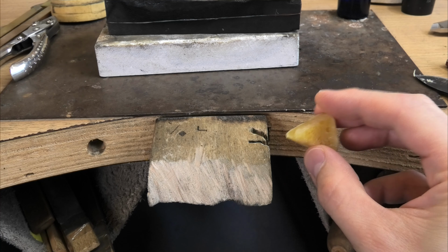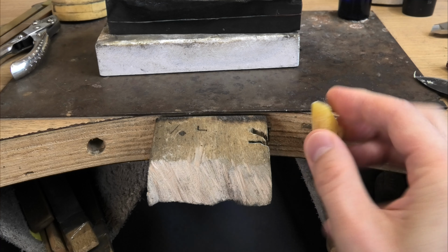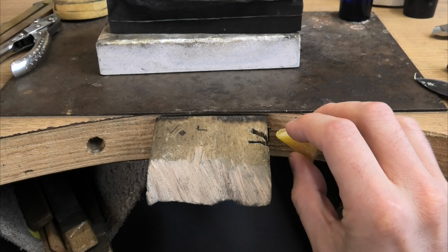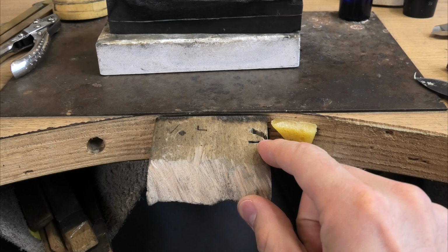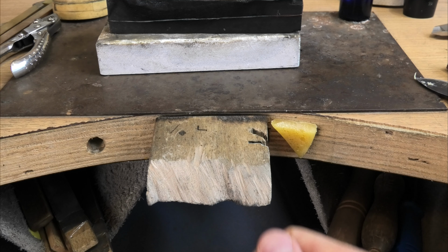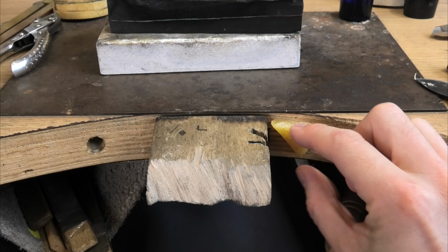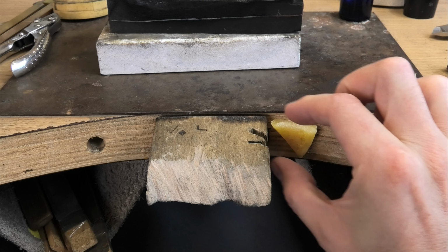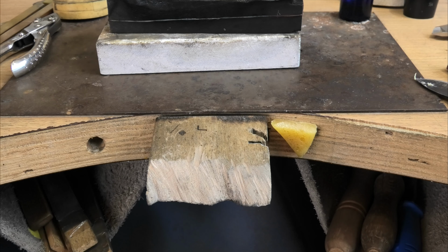If you have a bit of wax, you can put it just there. I mean, this is really sticky, but if you just melt it with a lighter, get the surface a bit damp, and squash it there. I wouldn't go too close to your bench peg, because if you're hammering, like with your ring stick against that, and it's touching the peg and stuck on there, the vibrations can knock it off. So have it away from your bench peg a little bit, but just stuck right there, and it's really convenient.